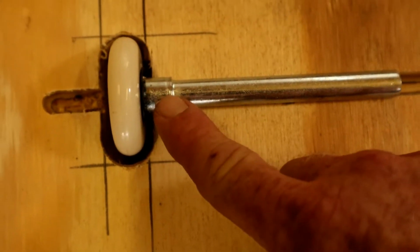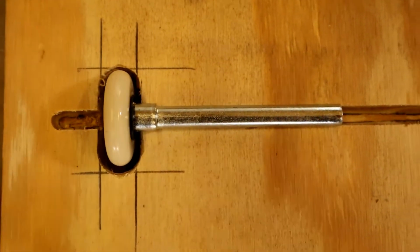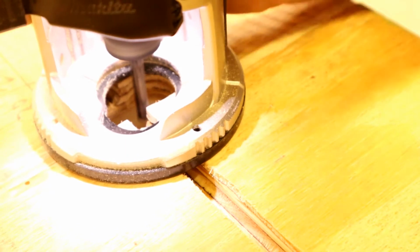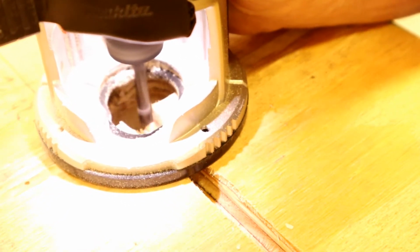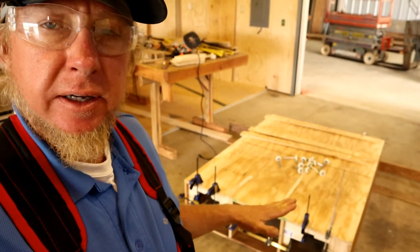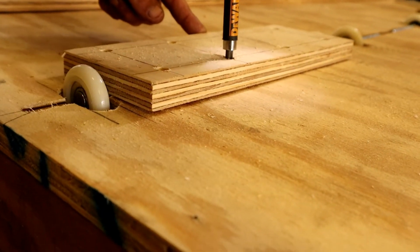This shaft right here looks about another good 3/32 thicker. So I'm going to route out a little section so that'll fit in, with this router bit to make this groove. The shaft on these garage door rollers are 7/16, but I think with the groove 1/16 smaller than the shaft, I can beat it in with a hammer, and that will secure and keep it in place, and then clamp these strips on top of it to hold it, and we'll be in business.